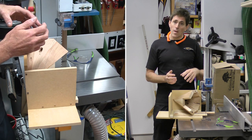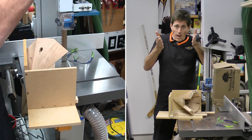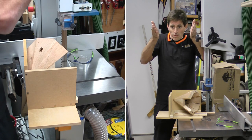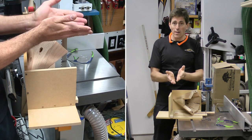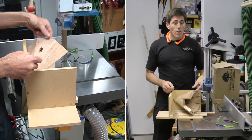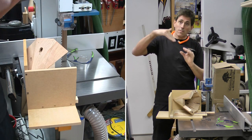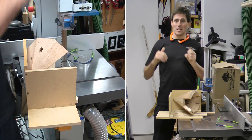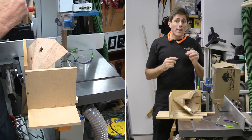But because of the taper, for one thing, you want that part removed properly so that the tapered sides, as you look head on into the table, are gonna flow, right? There's not gonna be a step where it comes down and suddenly it goes down an inch before it continues. It's gonna flow. But second of all, with the domino holes I already put in here, those are gonna need to have the right amount removed so that those holes remain linear, that there's no discrepancy, there's no step in there. And we can handle a little tiny bit of step, that's not a big deal, but you wanna get it kinda close.